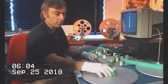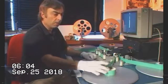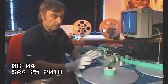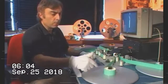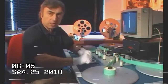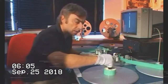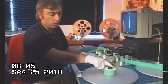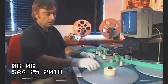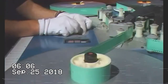Pushing it through and taking it up — there you go. Now some people who aren't that experienced with lacing films onto bobbins will use tape — not a good idea. If you put tape on the bobbin and then the film has been run and wound backwards, it can actually be quite tight and sometimes snap the film. So don't use tape. You can push it through the little areas that are cut in the bobbin or core. Just place it around, let it go through gently, got my thumb against the core, and there it is.